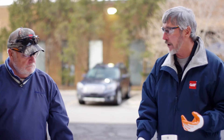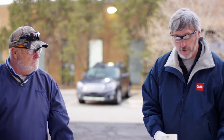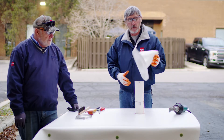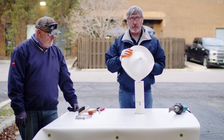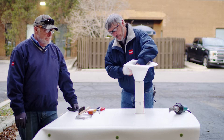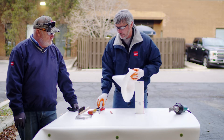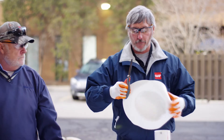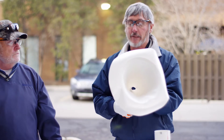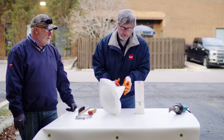So in this situation we really would need a target. We're going to install our four fasteners — just so everybody's aware, you've got to have the fasteners. Then we're going to install this over top. This accessory is for multiple sizes — it goes down to about a half inch or one inch pipe. We've got a three-inch pipe here, so I've got to cut it down. Put it on the pipe, take a pencil or marker, trace it, figure out what size you need, and we're going to cut this down. You really want this to fit tight, so I'm going to cut it a little snug. Better to make two cuts than one that's way too big.